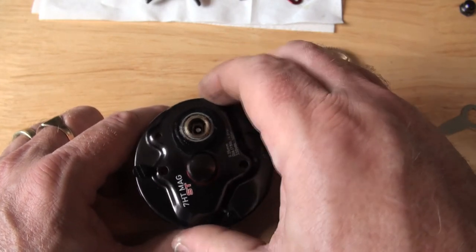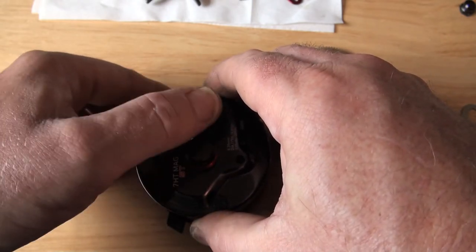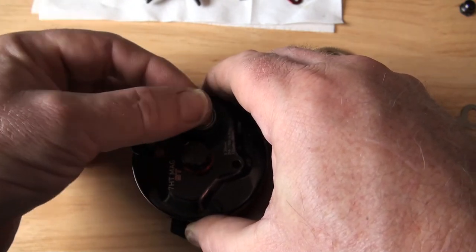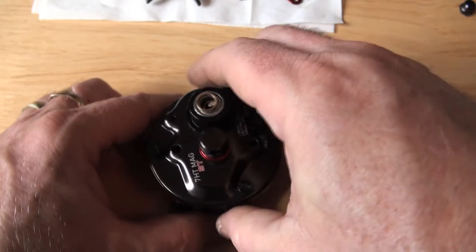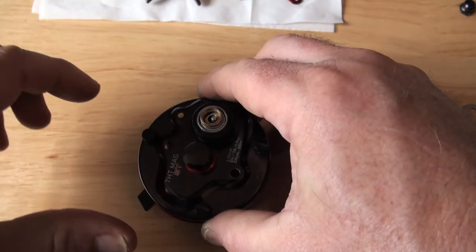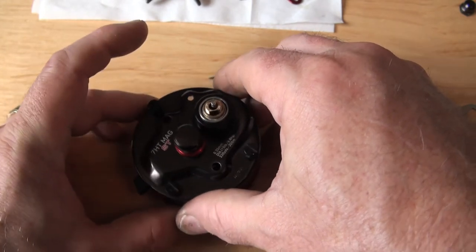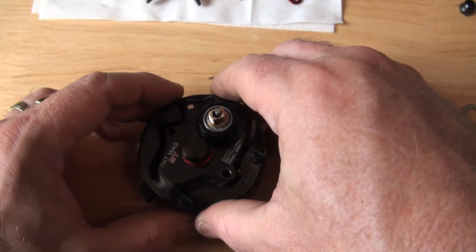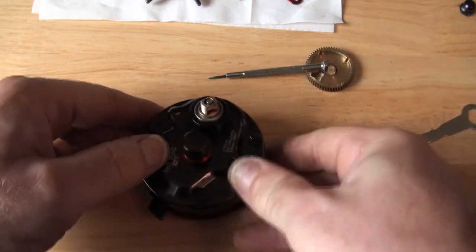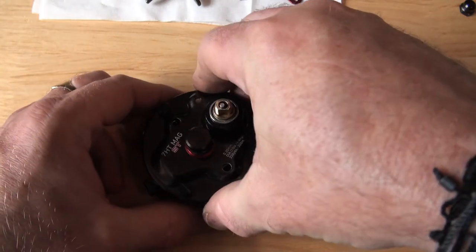The roller will pop out of the roller bearing, but it's just so much easier if you don't have to put it back in. And watch the brass bush that's there as well, and just persuade him to slide in and line it up. Go and slide it in, and then make sure that the springs haven't gone anywhere, and you've got to marry those springs up as well, and then just gently give it a push and down it should go.